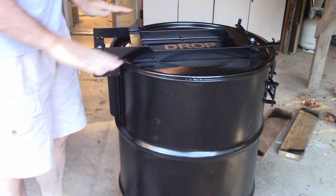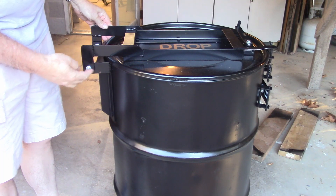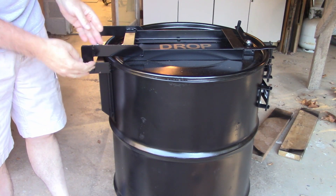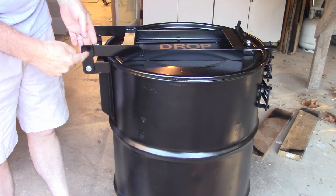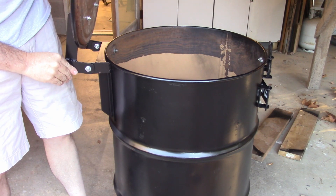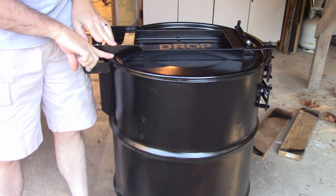The trickiest part about this is getting the lid to fit. I had made some mailboxes before and that's how I knew how to do this. You bring this out right underneath the lip right there, then bring it up. If you bring this part up high and hinge it there, your door's not going to open properly — it's got to come up and away, kind of like that action. So when this butts up against that, it comes up to the top and over the lip of your lid.